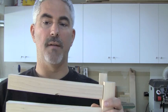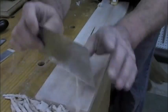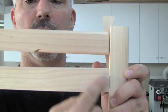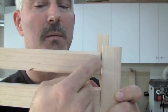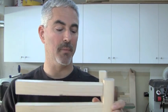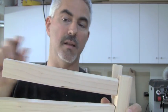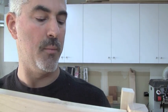The other thing I have to consider is that I do most of my sanding before assembly and then go back for final touch-up. A square corner is fairly easy to get into for touch-up sanding, but this rounded joint won't be so easy to reach with sandpaper after assembly. So when I do my preliminary sanding, I want to make sure I give extra attention to this round-over and get all the ends of these aprons nicely sanded before I put it together.